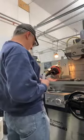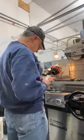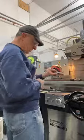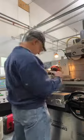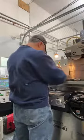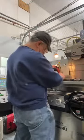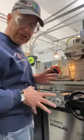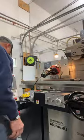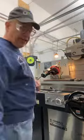So now on the side surface of the chuck, I'm wiping it. All right. And I'm going to use this as a spacer. Actually, I don't need the spacer. I'm just going to take this flat, put it up against the side of the chuck, and pull it till it's aligned. So now the sine plate is aligned to the front edge of the chuck. And all I have to do now is turn on the magnetic chuck, and it's going to stay put. And that's it. If I push on this, it is locked. It's not going anywhere.